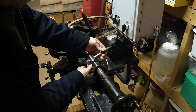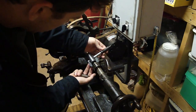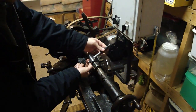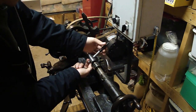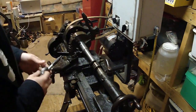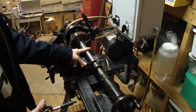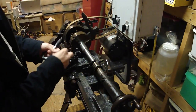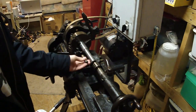I'm at .965, which is where I stopped on my finishing cut. And .938 is the final dimension I was working for. That'll give me a little bit of leftover to stick out. I'm basically going to turn about 3 inches of taper. This is 4 and a half inches I've cleaned out here.